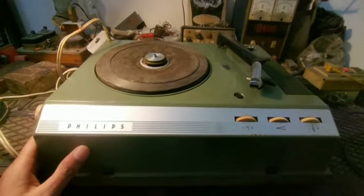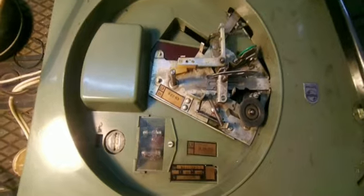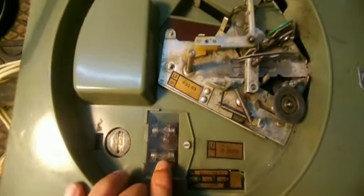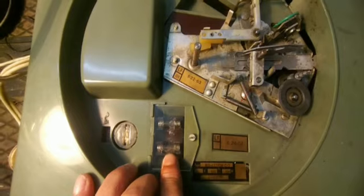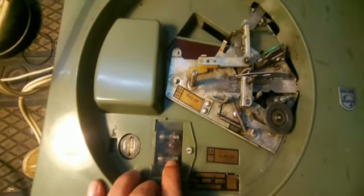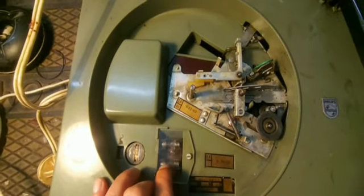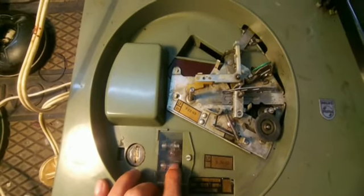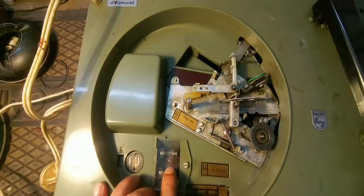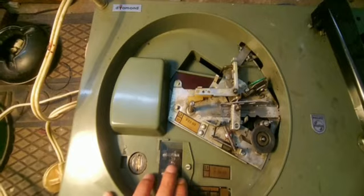This is the inside of the platter. There are two fuses, and if you see specifically, you can see that the fuses are actually gone — they have been replaced with an external wire. I have to check on those because if I keep it like that, there is no use for the fuse; it won't blow out and it might actually damage the set's inside electronics.